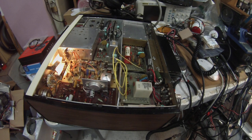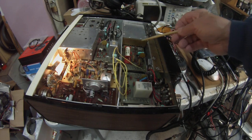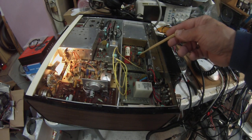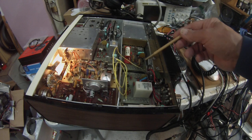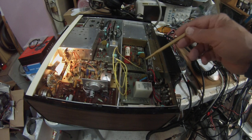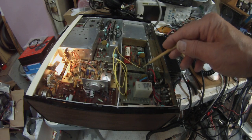This board over here is the SWR and ALC board. This little reed relay actually disconnects the receiver during transmit — a transmit signal opens the relay and breaks the signal path into the receiver sections. There's a little toroid here and a jumper bar; that jumper bar samples the 100-watt RF output and feeds it into this transistor, which is an RF amplifier. These two transistors are connected in a Darlington configuration to increase the current gain. Coming off the Darlington collector are two pins — one goes to an ALC light, the other is the ALC voltage.